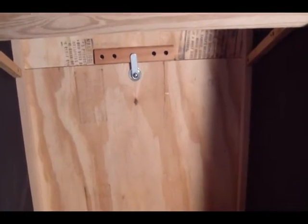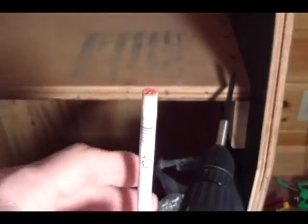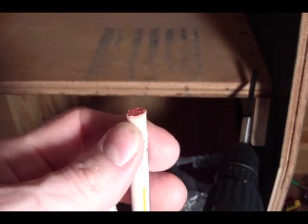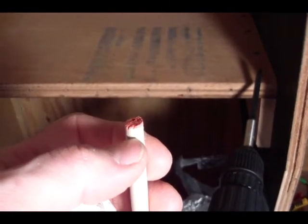We're going to paint everything on the inside the same color to match. I'm also going to take precautions with those holes on the cleats back there. I pre-drilled them so they could be countersunk. The screws on the rear cleats that you'll see a lot when opening and closing the cabinet — since they were drilled to be sunk — I'm going to cut little bits of a 3/8 inch dowel, cut some small plugs, and just temporarily stick a little rubber cement on there and glue them into those holes to protect the screw heads. I don't want paint collecting in there and running while it's drying.